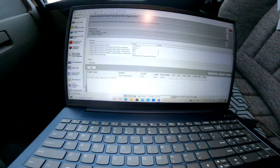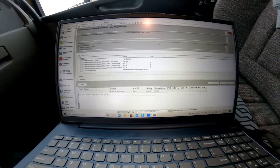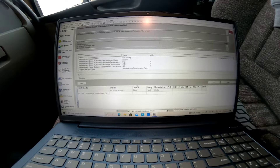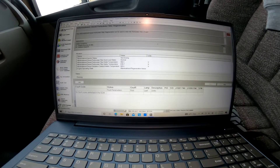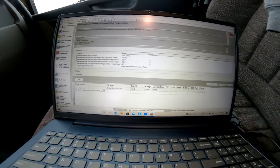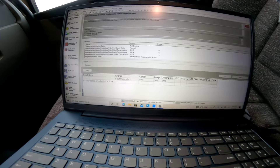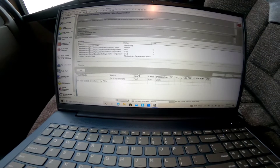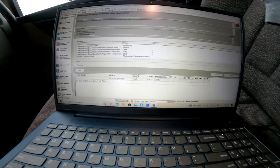Temperatures are declining now. We got all the way up to 1030 for the inlet; it's at 680 right now. The outlet's higher — that's crazy, maybe it's just catching up. Right now the inlet is higher than the outlet, which is how it's supposed to be. If it's the opposite, that means there's stuff going on in there and the DPF is on the way out. Let's see if it passes — I don't even know if it's gonna pass. There's about a 100-degree difference right now, so we might be getting more stuff from Peterbilt.